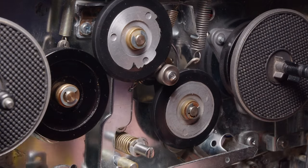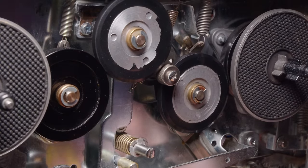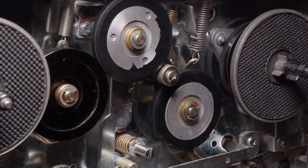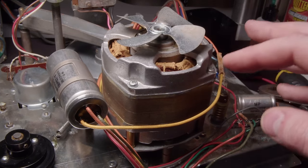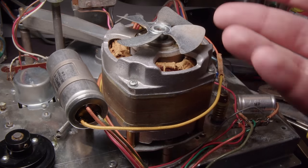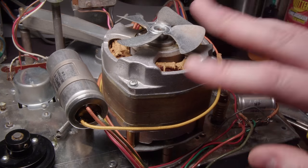And so as soon as I would put a reel of tape on this, it would just slow down to nothing. I've been messing around with it for so long, trying to figure out what's wrong with it. In my process of repair, I ended up completely disassembling the motor to make sure that it all was good, and it was very clean. I had thought that maybe putting it in the dishwasher did kill it, but no, it seemed fine. I just re-lubricated, put it back together, still didn't work.